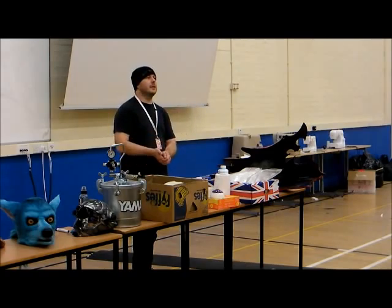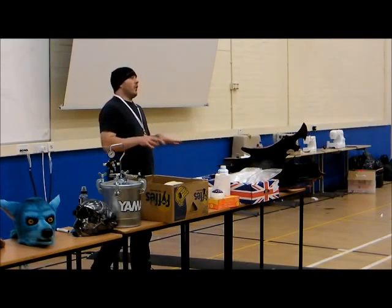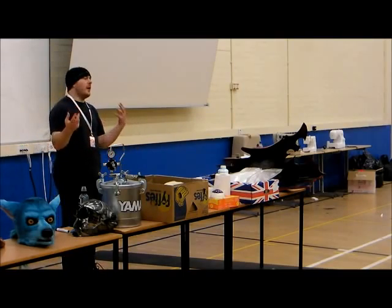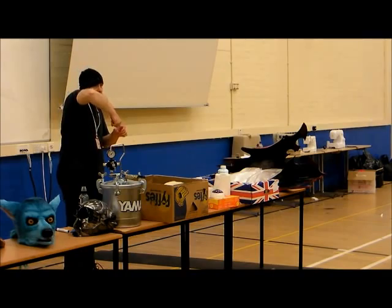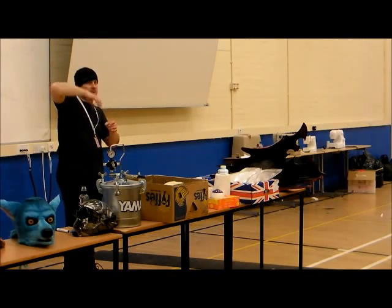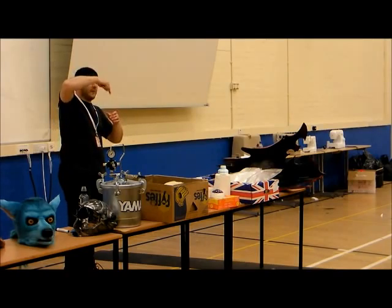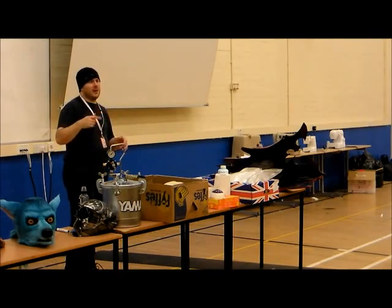So with the hot glue, do you use it from the glue gun, or do you use it from a little sort of melted hot glue? Right. There are different ways to do it. If you saw my werewolf yesterday, the claws are hot glue as well. I made a little latex mold, got a hot glue gun, stuck it in the bottom, and squeezed. I kept the nozzle underneath the hot glue as I brought it up, and sort of brought it out as it was filling up. That just makes it so it flows rather than fills. You don't want to fill, you want it to flow over the surface. That way you get nice smooth and you don't get wrinkles.